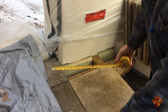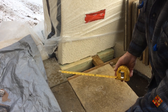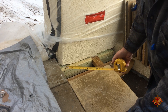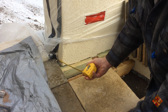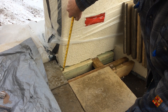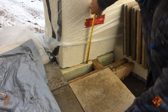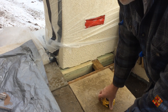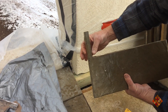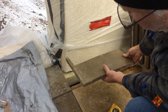Here we have a column that was built after the deck, so the column shoots out into the deck. We had to take extra treated 2x4s and screw them to the back to bring it out so we have something to rest on — you can't set tile on air. You have to add extra pieces wherever you need them. Also, where the tile doesn't quite reach, I cut this little piece at an angle — you have to be careful not to break it — and then it goes in like that.